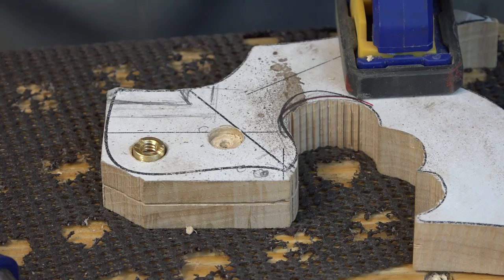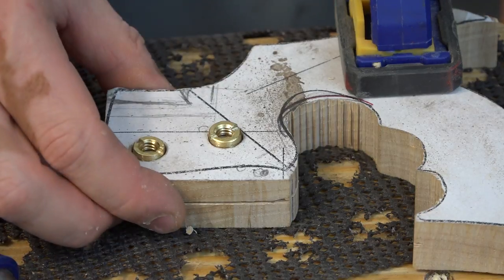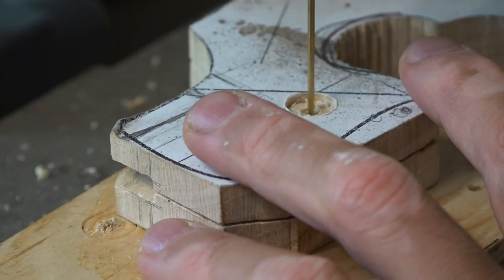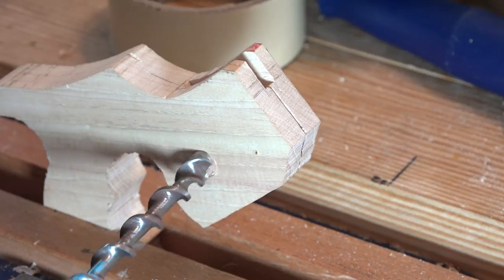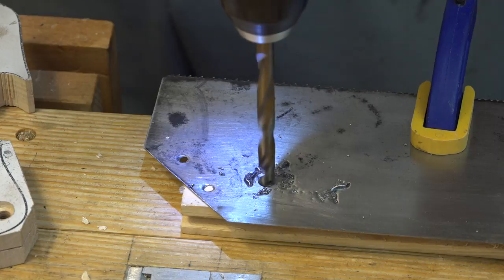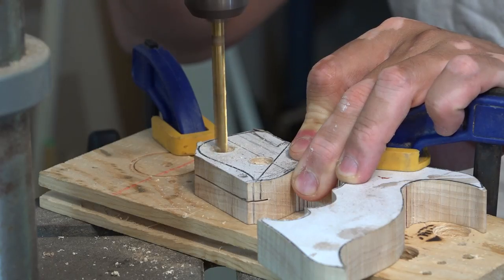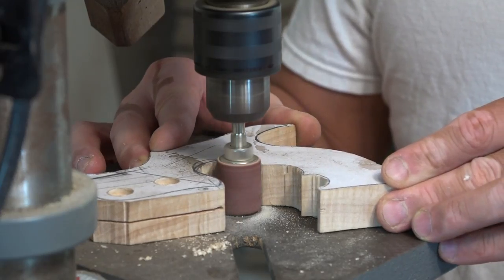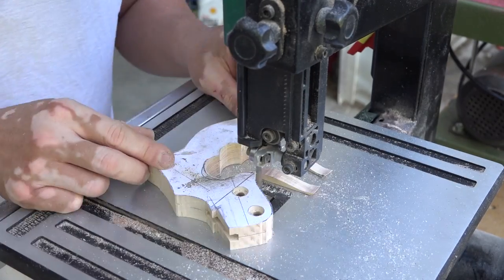Using a brace and bit, I made pilot divots for where I would put the slotted brass nuts — if you want to see how those are made, follow the link in the description. The snails of the bits left a nice pilot hole that I followed with a drill press so I could locate the holes on the other side, and I made similar divots. I then marked the position of these bolts onto the saw plate and drilled the corresponding holes. Once I was able to fit all the big pieces together and it looked like it was going to work, I was ready to turn my attention to the cosmetics and fit and feel of the project.